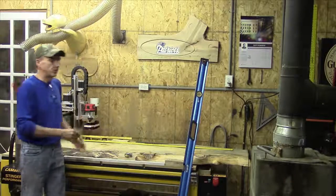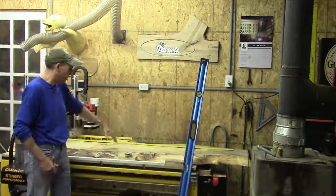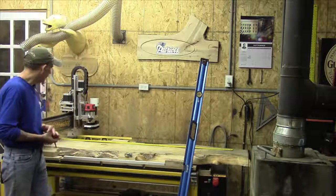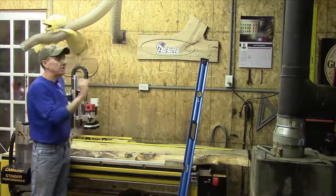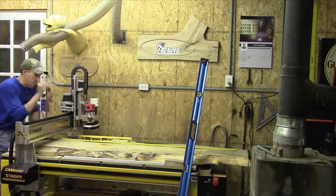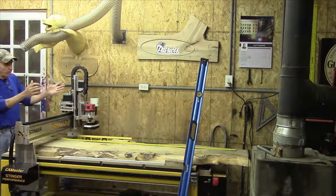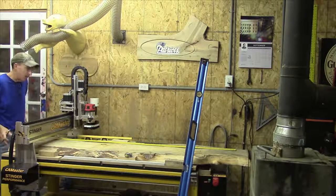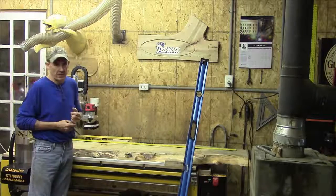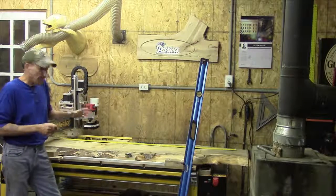Now, this is non-symmetrical material — it's crazy, it's wavy. It's 24 inches at one point, it's 15 and a half here. It's got highs, it's got lows. We've got to try to find the best of all the evils here. After you do your centers, stand back — you're going to do a lot of eyeballing on this stuff. I'll stand back at the other end of the shop and eyeball that line. If the line's kind of crooked, I've got to tweak my slab over just a little, redraw another line, look at it. When I'm happy with my line — eyeballing it and knowing it's about as straight as I can visually get it — I leave the slab.